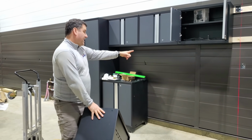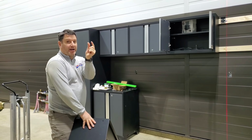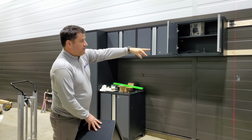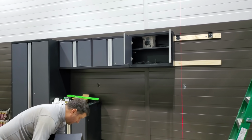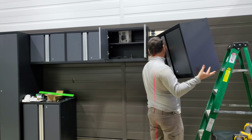We had to deal with that tin has got 1.5 inches of air gap behind it. So we had to use longer screws, and you have to make sure that when you're near a seam, you can tighten them pretty good, but if you're in the middle, you can't tighten them a lot, otherwise it squishes the tin. But we got it mounted really nicely on the studs.